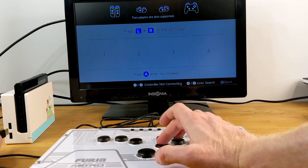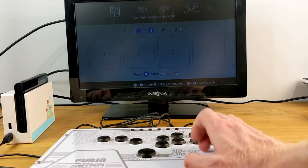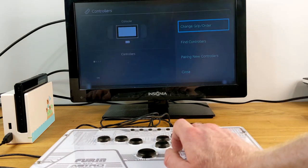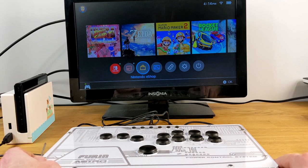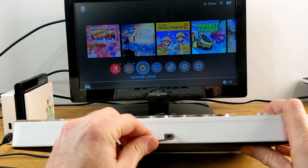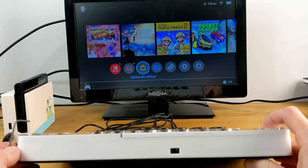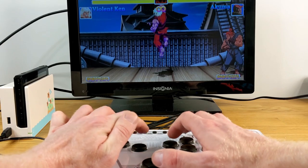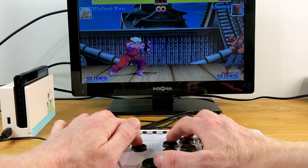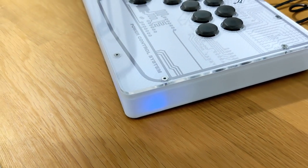Now let's check out this stick in action. Since my version is using a Brook UFB, to connect it to the Switch I have to press and hold down one kick while I plug it in, and then it should connect A-OK. The Brook UFB is an amazing PCB compatible with a ton of different systems. I did notice one issue right away — I couldn't press that jump button to move up, and that was because I forgot to change that switch on the very bottom. So if you are changing up your top panel, you may or may not have to activate this switch. I just used the included Allen wrench to switch that over and it seemed to work just fine. In terms of overall responsiveness, the buttons feel good and everything worked as anticipated. I had no issues with anything whatsoever. Although this case doesn't have LEDs, I did notice the blue LED from the Brook board glowing through the side, so if you wanted to add some LED strips in here, I think that wouldn't be an issue at all.